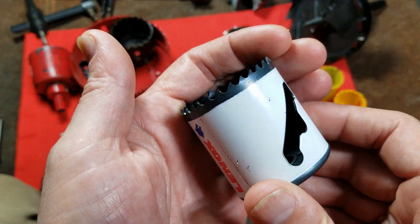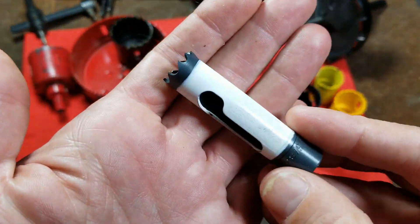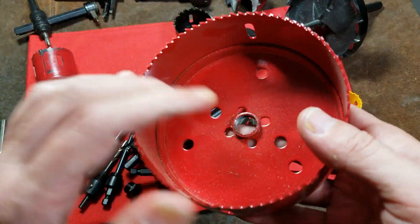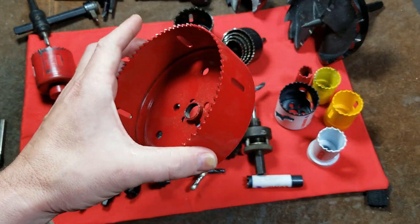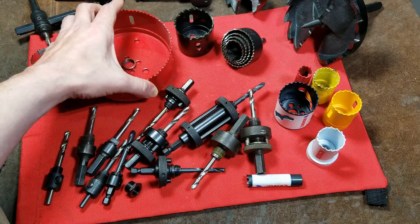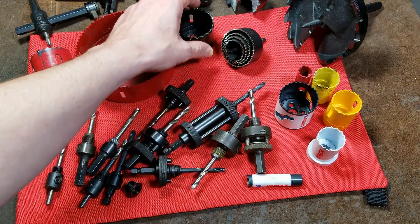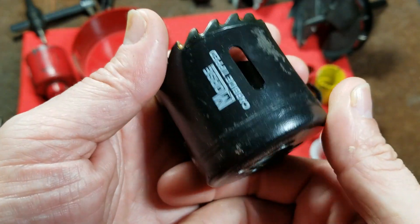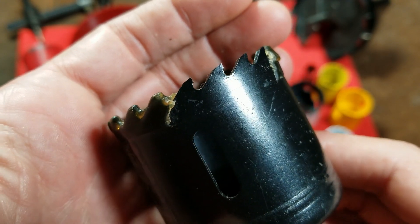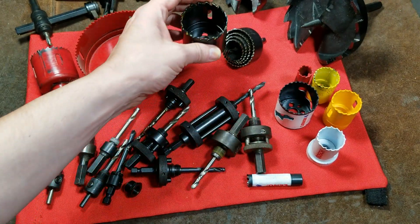Although for how long hole saws last, the thin-wall issue may not be as big a deal as I thought. Hole saws can be made tiny — like this little 5/8-inch Lennox — or large, like this five-inch Morse, and they go up to six inches. Large hole saws are used for things like recessed lighting in construction, which often require five or six-inch holes. There are also high-performance carbide-tipped versions, like this Morse, with little carbide teeth similar to carbide-tooth reciprocating saw blades — champions at metal cutting.